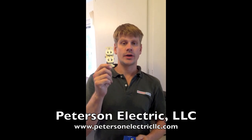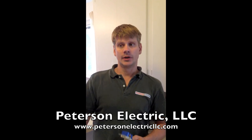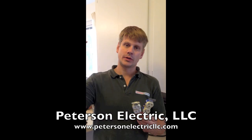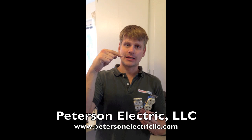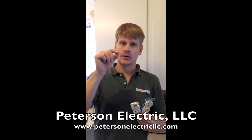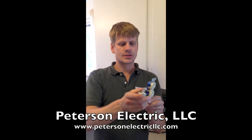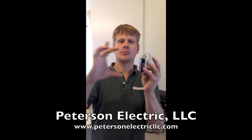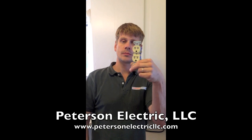Technically, when you sell your home, if you're replacing these and you have no grounds, you need to put these two-prongs back. But some people don't realize that inside of those little metal boxes is what we call a hickey, and it screws down and it chokes the wire. I have gotten in there before and found the ground wire and rewrapped it, and then once I screw these screws through this yoke of the device into the box, it grounds it and we put in three-prong.